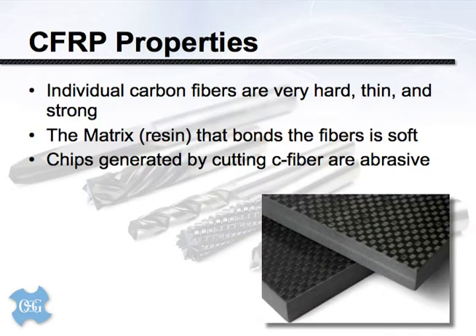When we think about machining carbon fiber composites specifically, it is quite different from metal cutting. I come from a metal cutting background and it was a big change. Within the matrix you have individual carbon fibers that are incredibly strong — a lot of people refer to this material as ten times stronger than steel. They are also very small diameter fibers. When combined with the matrix, you end up with a chip or swarf that is phenomenally abrasive — very different than metal.